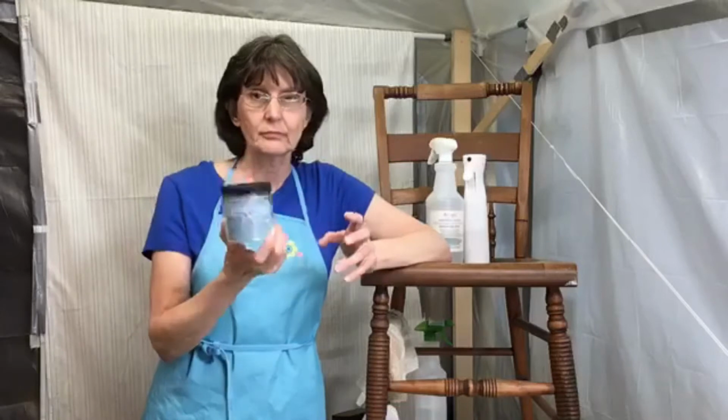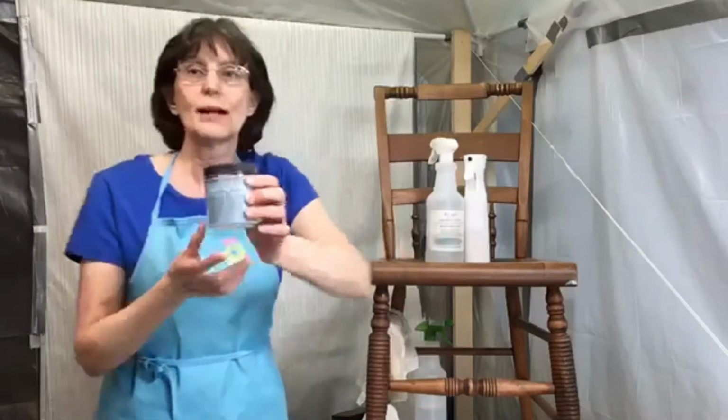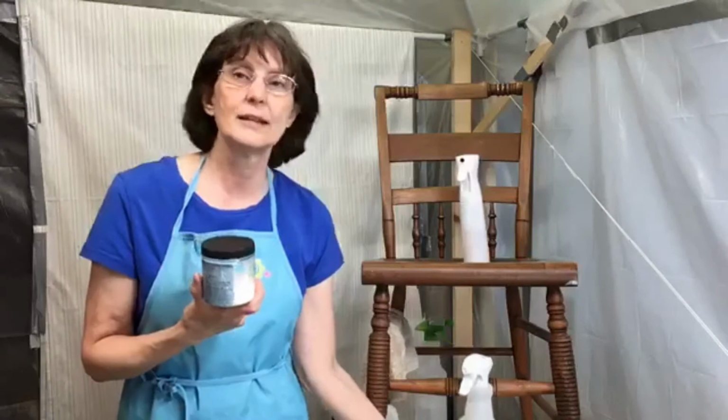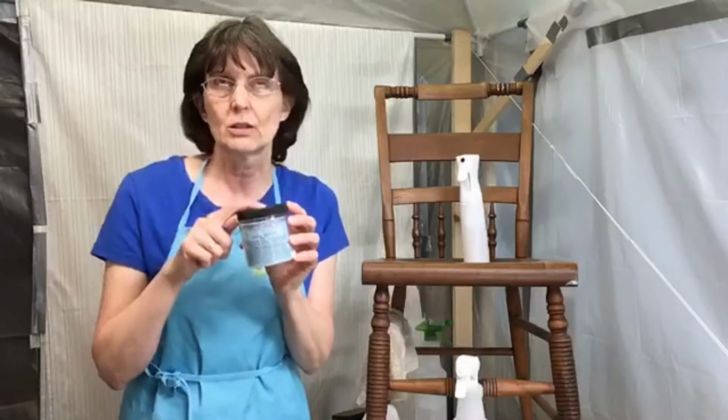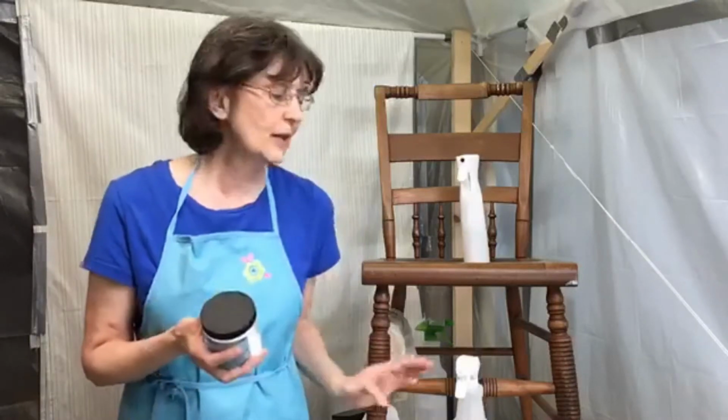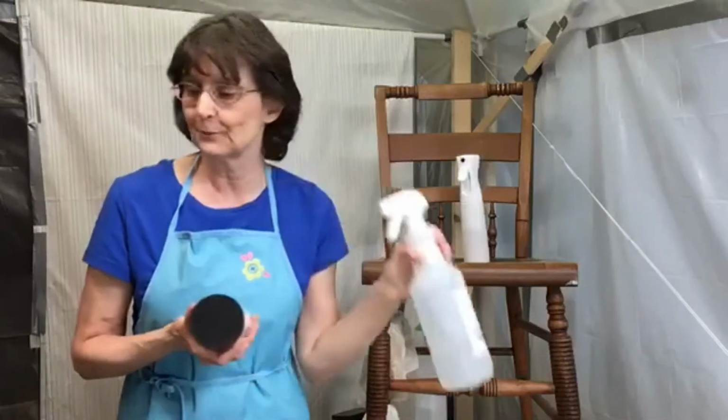But let me tell you what I recommend. I recommend Dixie Belle's White Lightning Cleaner. It's a TSP product, and it's a granular form. It comes in an 8-ounce jar. Basically, the recipe is 2 heaping tablespoons of this into a gallon of hot water. And then what I normally do is I'll mix it up a gallon at a time, and then I'll put it in my handy dandy spray bottle here.